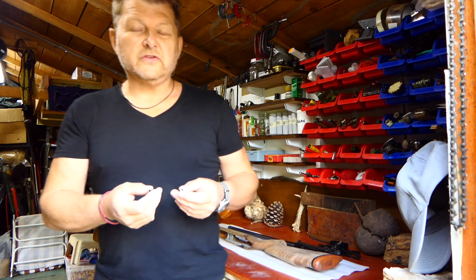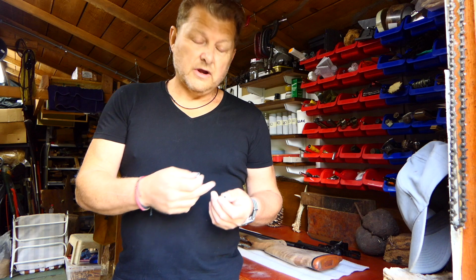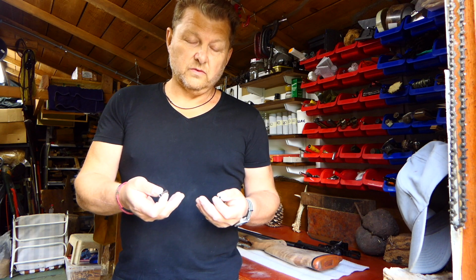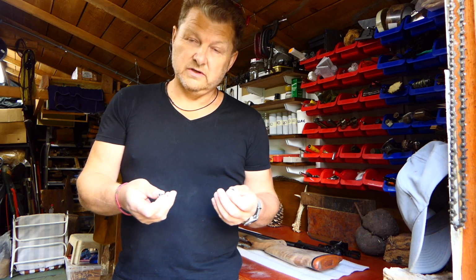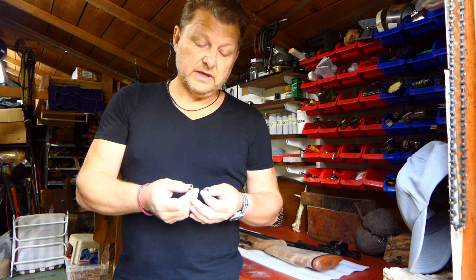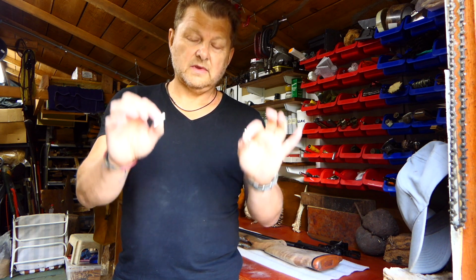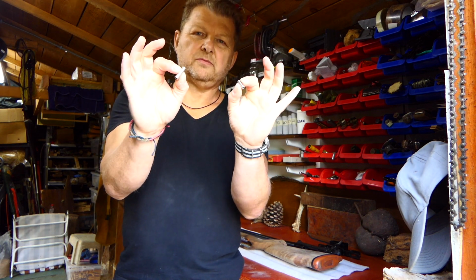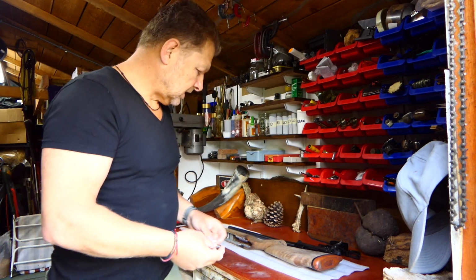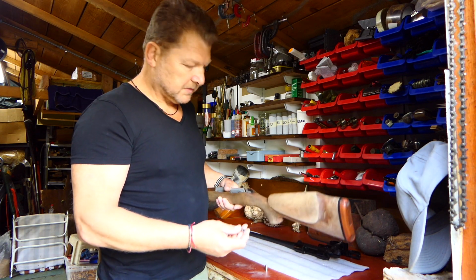Now we've already made two pillars for this particular rifle. Bear in mind it's used, so the stock will have compressed some, so it's not as it was in the factory. So I've just made them to measure. All they are is very thick walled stainless steel tube. That's it. Two tubes. That's pillar bedding. Simple as that. Some people like to use brass, aluminium, doesn't matter.